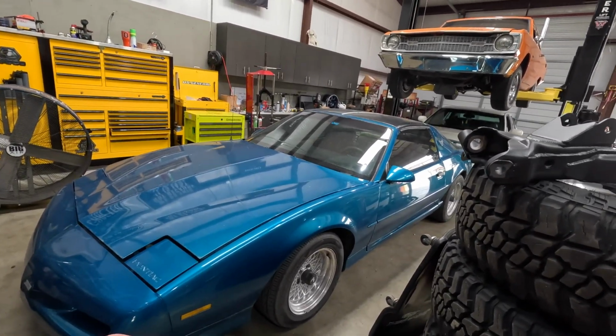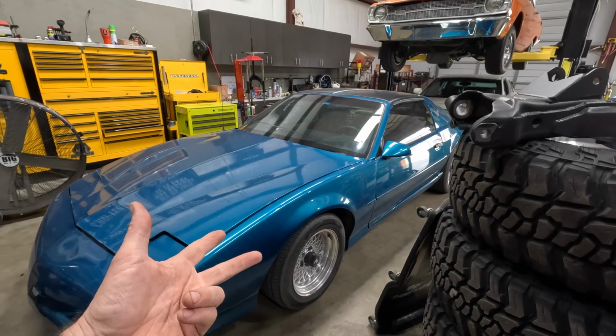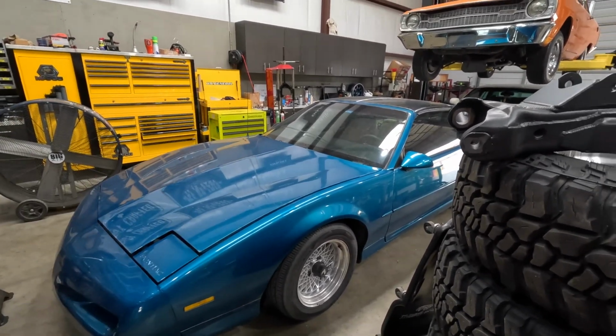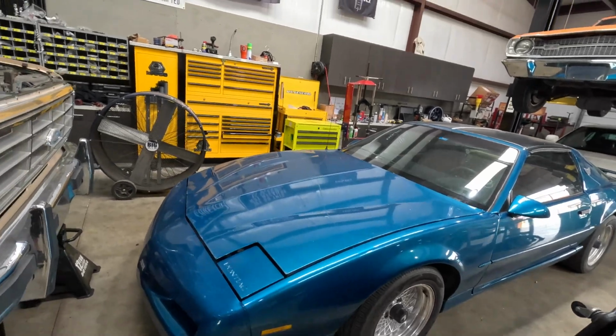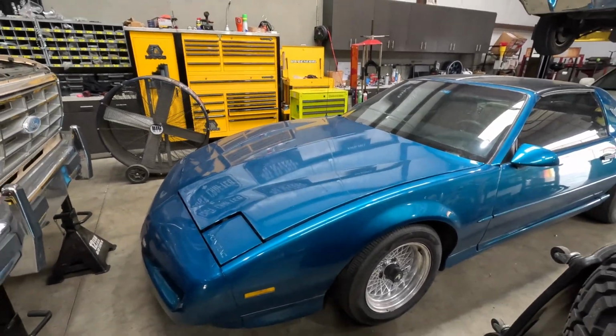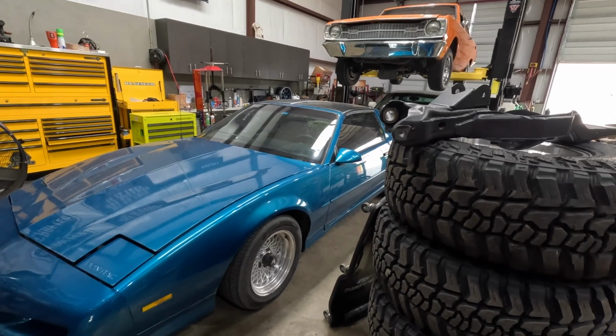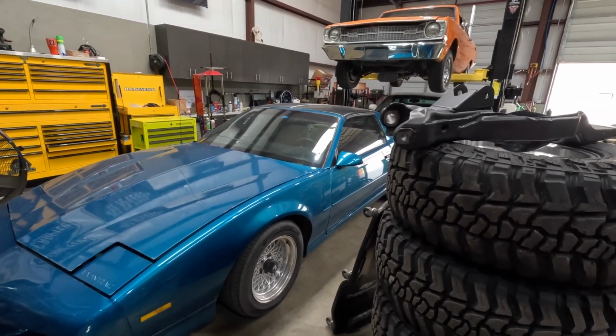And I got a set of gears and subframe connectors and sway bars that we may be putting on this go-around. I don't know. They haven't told me exactly if we're going to do that yet or not. It just kind of depends on what it takes to get these couple oil leaks fixed. LSs and rear main seals are a thing. The problem with this one is you got to take the motor and tranny out the bottom in order to get it out. There is no room from the firewall to get the trans out of it.